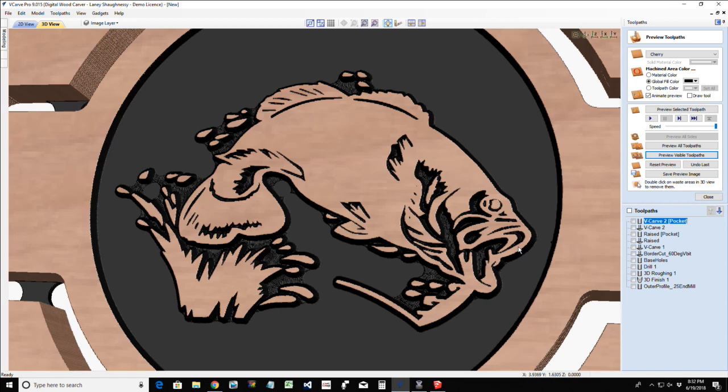All right, let's see here what we have. How do I 3D the fish we are doing? Yeah, Howard, end mill or ball nose? End mill for your rough cut, ball nose for your 3D finishes. Always use a ball nose for your 3D finish. And again, it all depends on the detail where you need to get. If your eighth inch bit diameter is too big, it's not going to get into those areas, and you're going to have less detail. 16th inch may get into them a little bit better. The 32nd, a very nice fine tip ball nose, will get into those details. Was that good? Okay, Rochelle, good.